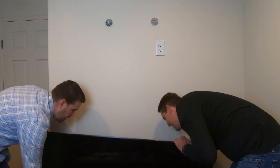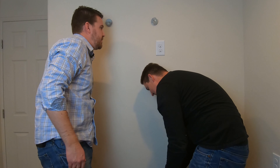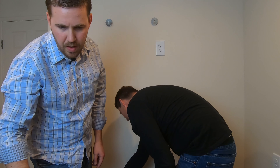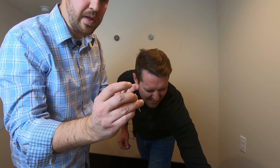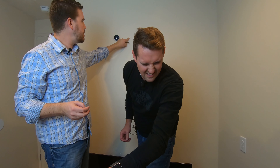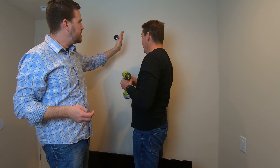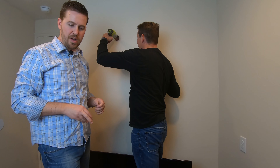You've got one in a stud so it's not going to fall off the wall, but bring one in a little bit closer with your anchor. We're going to pre-drill for one of these anchors and actually screw into this anchor a little bit closer. On 16-inch on-center studs we may have been just off a little bit — just close but not close enough.